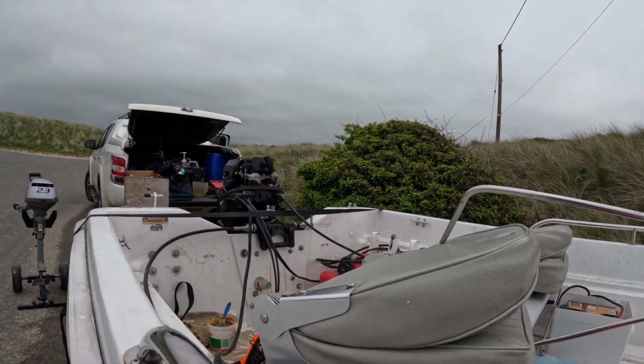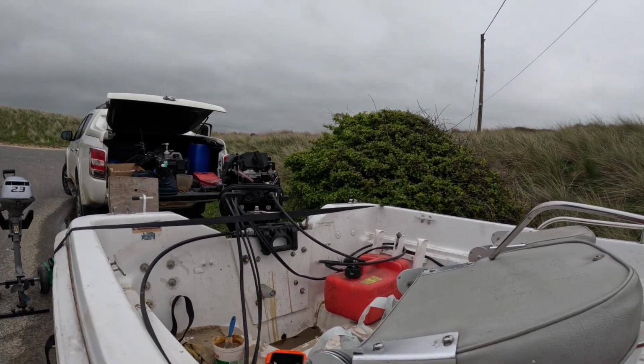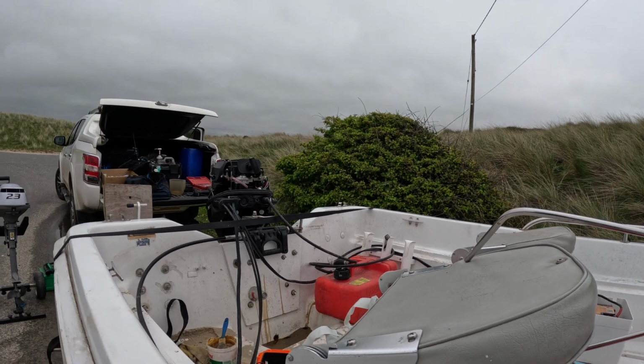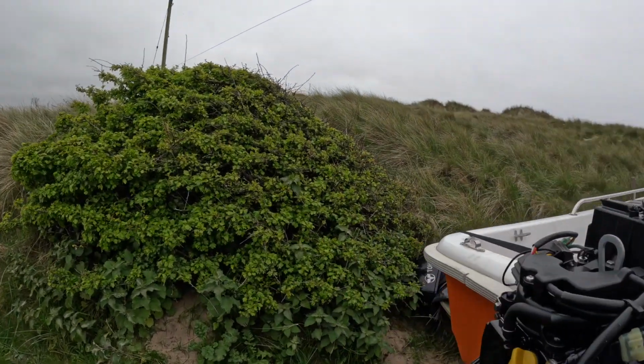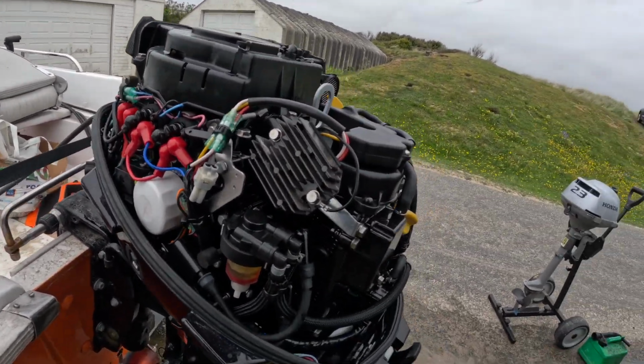So it's easy up to there, and now it's gone stiff, as we are packing the grease into where it needs to go. So that's just prolonged the length of that steering cable by about 5 years compared to if you didn't do it. All right, let's nip this up.